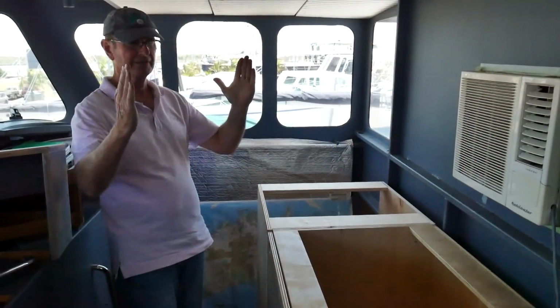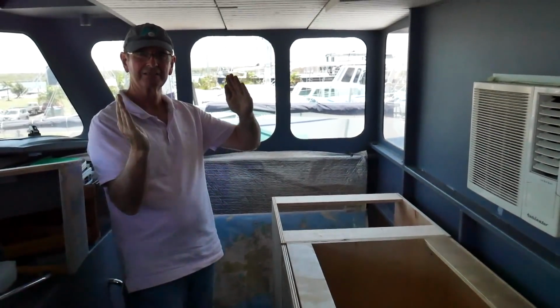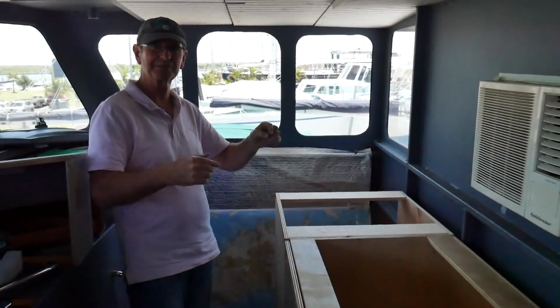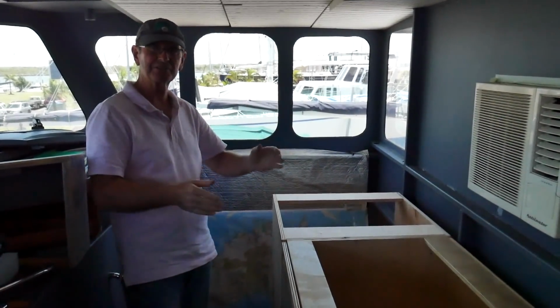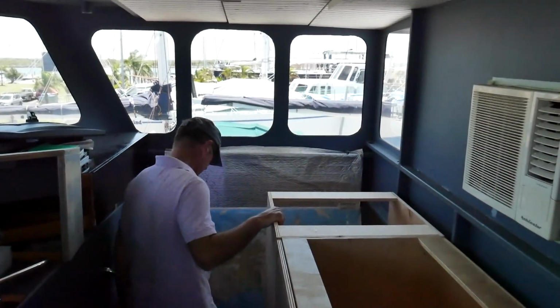The drawers. Yep. Because the lower part of the cabinet can flex either way. So when you put the shims in, when the final shims go in, you just make sure it's straight and then it'll be beautiful. Yeah, alright, cool. But it's doing a good job at the moment. Yeah, nice, nice.